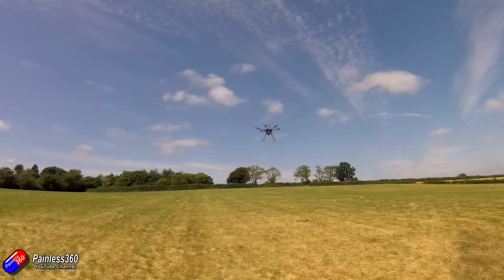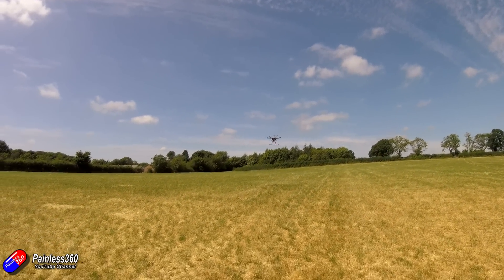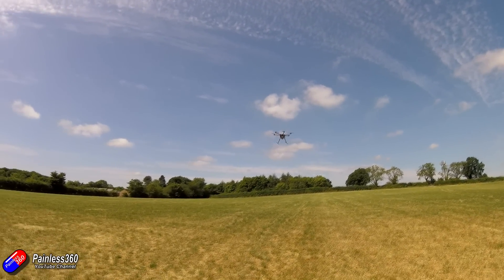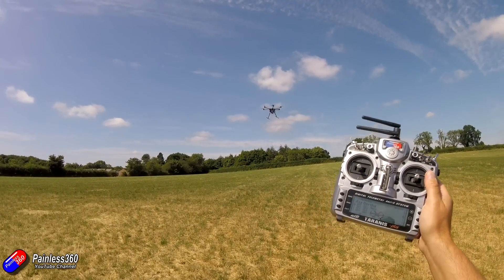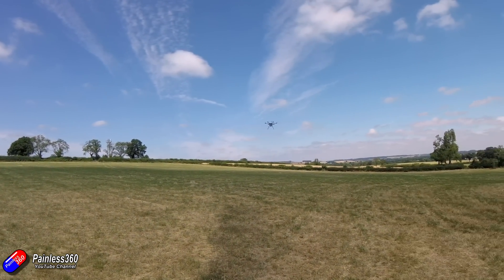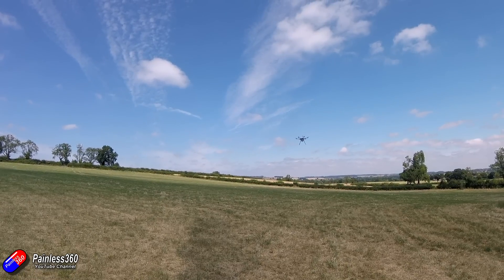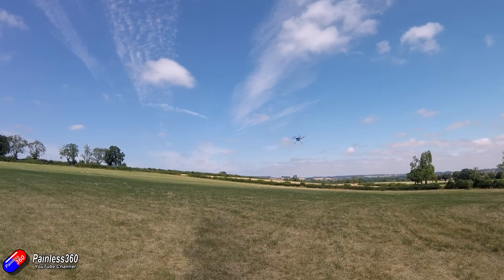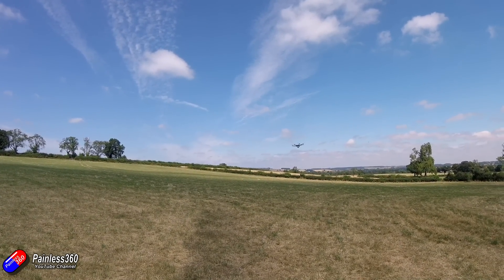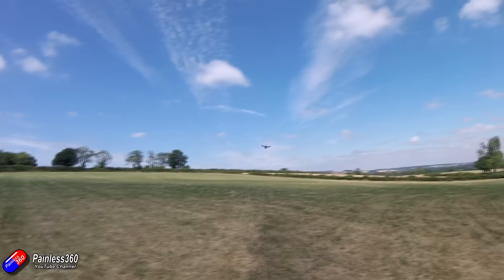At the moment we don't have a gimbal or anything else, but with the reduced weight I should be getting about 15 minutes out of this battery. It's going to need an auto-tune — it's very sloppy. So we went through the auto-tune process, which is fantastically covered in the Arducopter wiki pages — I'll put a link in the description. It's flying really well, and a quick check of the landing gear shows it's retracting and dropping. Ben also set it up so that in the event of a return to home it drops the landing gear as well, descends and stops on top of it.